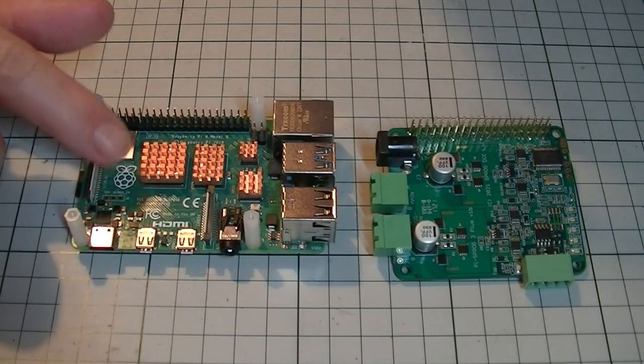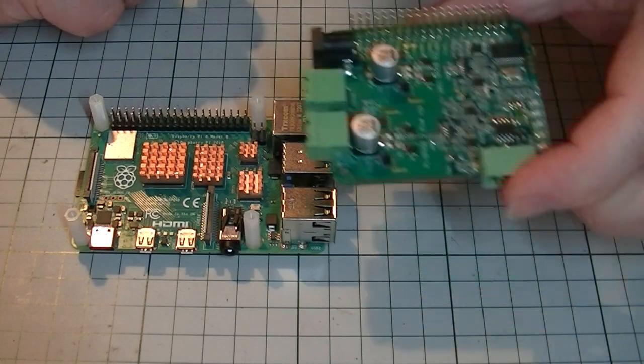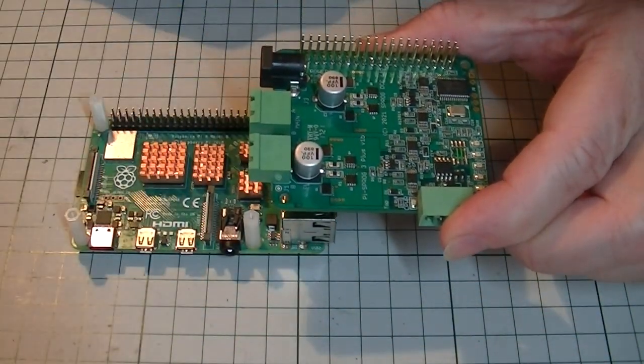At the moment I'm using a Raspberry Pi 4 running JMRI software with a Pi Sprog 3 Plus board, which is a dual output DCC interface for the Pi. I'm very pleased with the way it all works, and as the Pi supports Wi-Fi it gives me several options for controlling my layout. I'm able to use either Engine Driver on Android or Wi-Fi Throttle on the iPhone to connect to the JMRI software on the Pi, so running locos is straightforward.